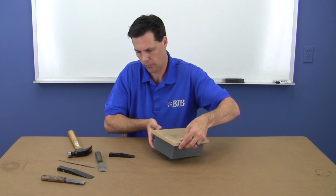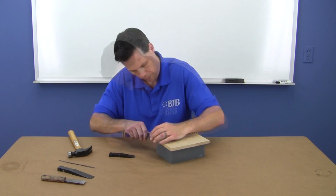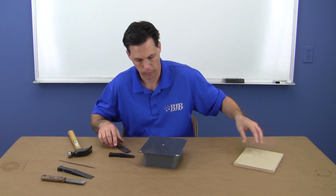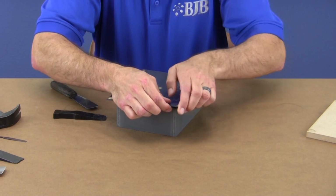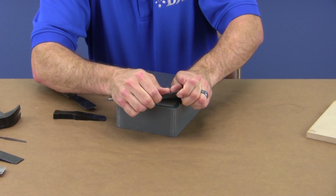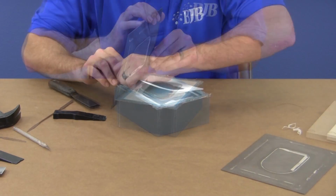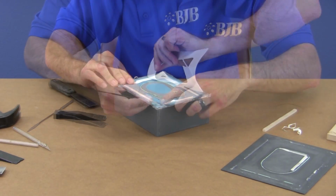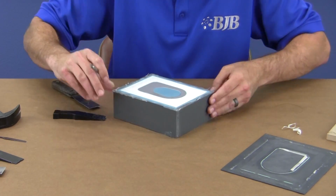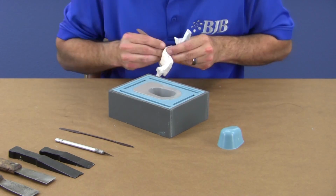After an overnight cure, we begin to remove the splitter board from the bottom of the mold box. Note that I purposely used a thinner piece of plastic supported by a thicker piece of MDF wood. Being able to flex the splitter board makes it much easier to peel away from the aggressive double-sided tape holding things together. Once that's gone, I remove the styrene sheet, alignment keys, and trim any silicone flashing with a sharp hobby knife. The last thing to clean up is the oil-based clay used to seal gaps.